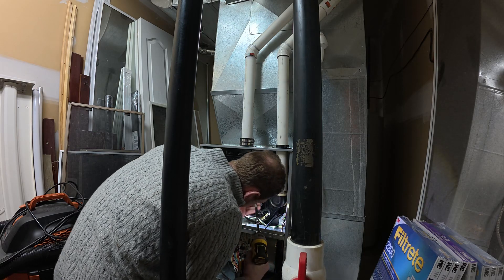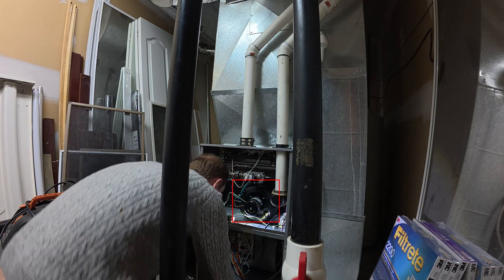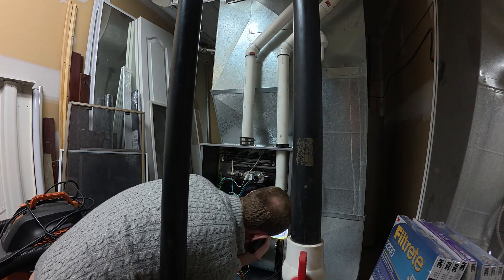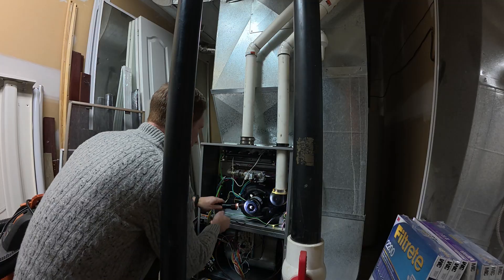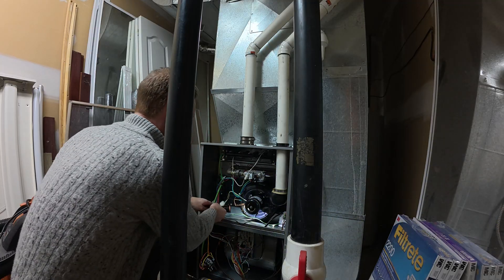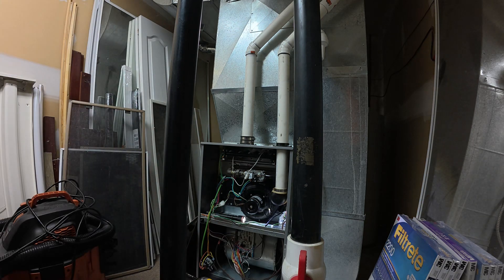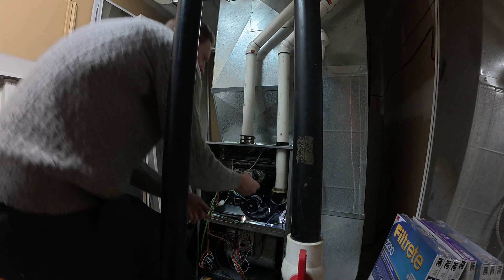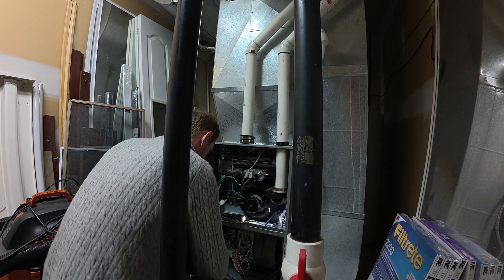You can see in the video I have my drill and I'm taking off this motor — not the motor that creates airflow, but the one that removes the carbon monoxide and burn gases, sucking them out from the furnace and kicking them out through the exhaust. I've done this before and watched the repair guy do it. Initially I thought it was the pressure switch because that's what the error message pointed to, and it's possible it can be the pressure switch.